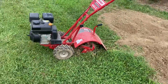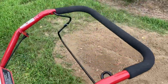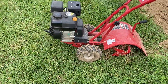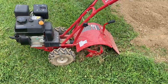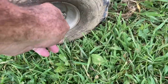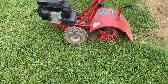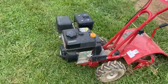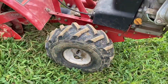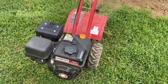Getting it ready for fall. All it is is pull this and that turns on the tines and the wheels at the same time. The wheels are locked in with the tines. If you pull that pin out and push the wheel in a little bit, there's another hole that allows you to push it freely. You do it on both sides — those pins come out easy, you push the wheel in, and then you can push it across the yard to your destination.